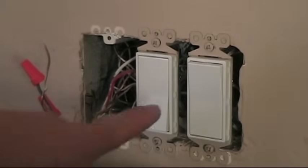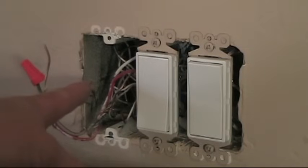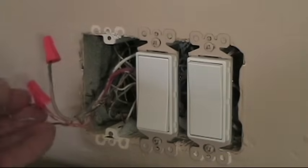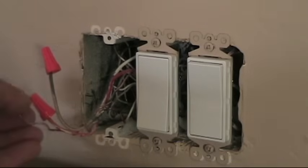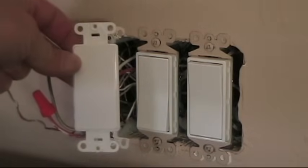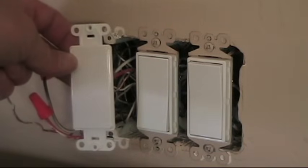Here's what we've done: kept the first switch position the same, redid the splices and put the wires on the screw terminals instead of push-in connections. I moved the switch that was the third one running the black wire — now the master control for our remote-controlled fan — to the second position. I've capped off the hot wire and the red wire: the hot that supplied the previous light switch and the red wire in the three-wire cable that goes up to the ceiling fan. They're both capped off along with their ground wire, and tucked into the back of the box.